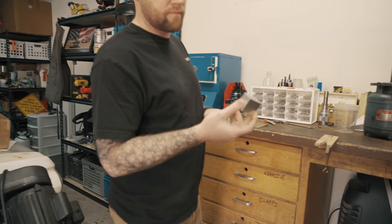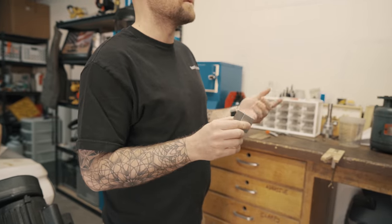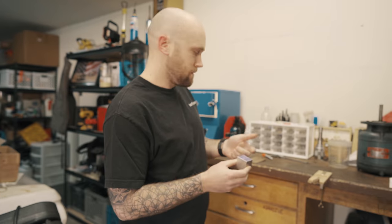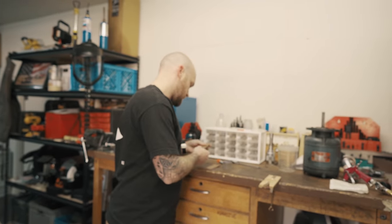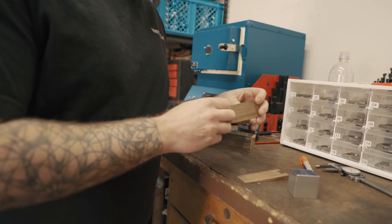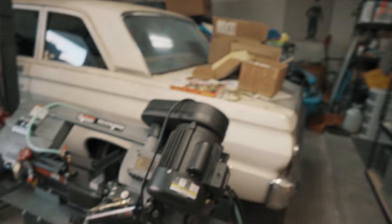So this is inch and a half by inch and a half square aluminum. I just chopped a piece off on the bandsaw and then milled it to the rough dimensions that you sent in your sketch. So right now it's inch and a half wide, inch and a half tall, and inch and a quarter in width, I guess. So I just needed these wedges. I'm gonna figure out the exact taper of these wedges, and then basically all I'm gonna do is spot the hole in the top.